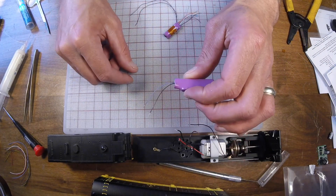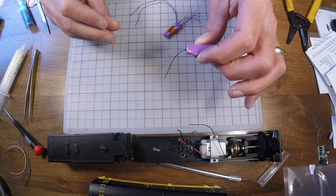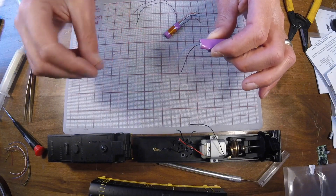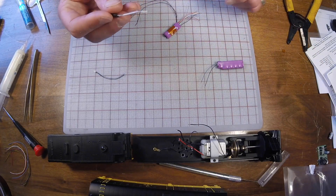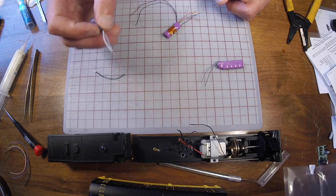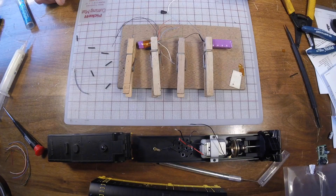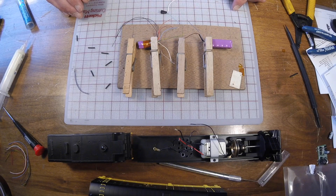To install a current keeper on the TSU-1100, we don't need the plug end of it — it's going to get hardwired to two of the wires on this decoder. So we've cut that off and trimmed and tinned the wires on the current keeper. I also have pre-trimmed and set up a two-pin plug that's going to connect to our lighting already installed into the rotary car body. I like to build a sub-assembly of my decoder, any connectors, current keeper, and extra pieces, then do a final assembly in the model once that's all put together.